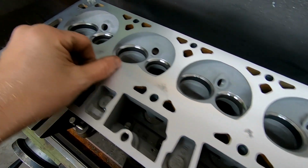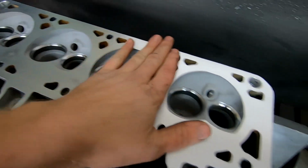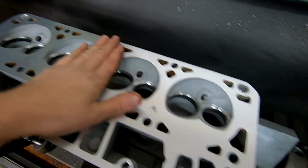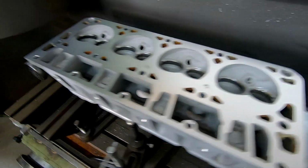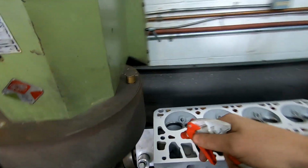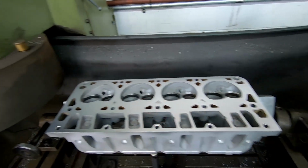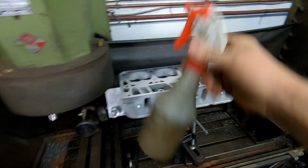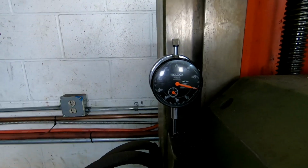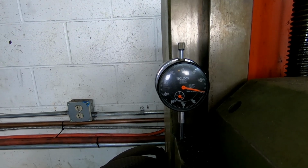I wasn't doing a finish pass there. So even though that could potentially seal, we don't want potentially, we want it to seal. And so for that, I have a little trick here. Sometimes aluminum chips will stick to the surface, and WD-40, which is in here, helps prevent that. I'll go back to the hand wheel and we'll bump.